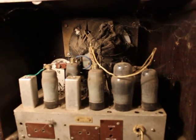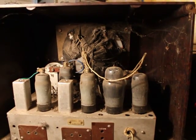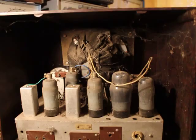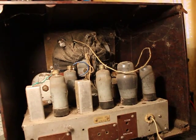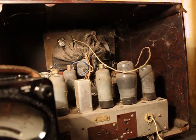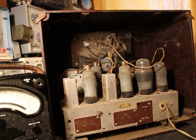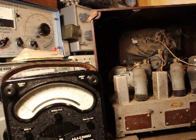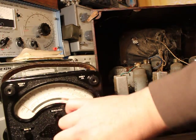You can see inside it's glorious. Right, first thing I'm going to do — I'll leave you looking at the glories of this cabinet — I'm going to get a meter. What I'm going to do is put the radio back over here a little bit. Hopefully you'll be able to see the meter. What I'm going to do is just put the mains lead on and set this to ohms.